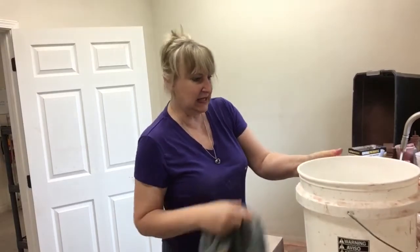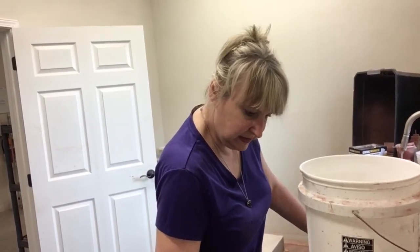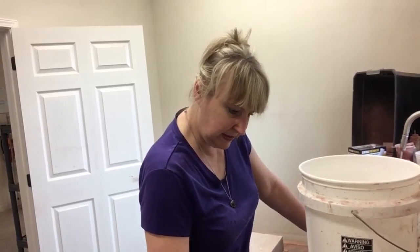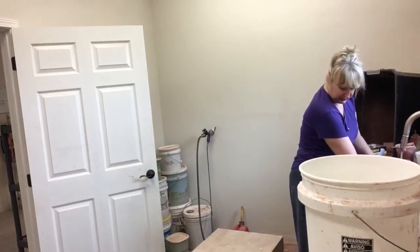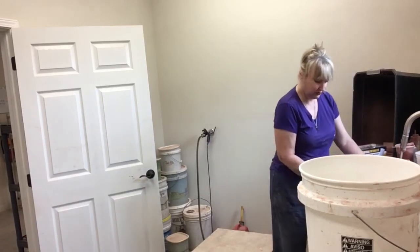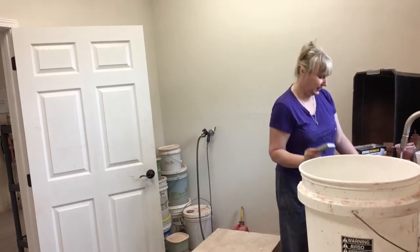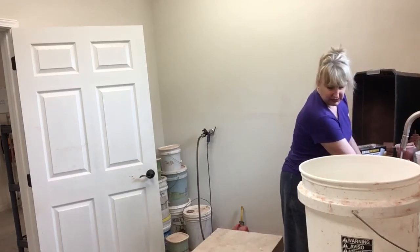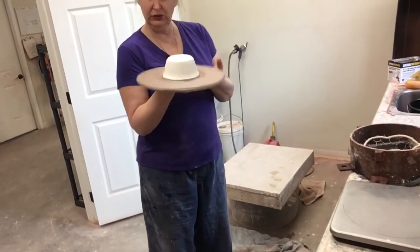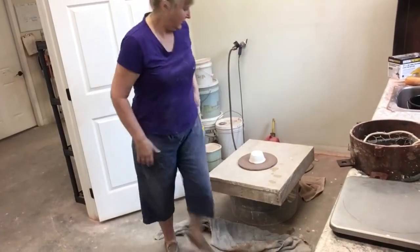I have my scale here, set it to zero to account for the bucket weight, then I'm getting water in and working to get the temperature right at about 72. I'm using a thermometer intended for cooking turkeys — it's quite accurate. I've got the water too warm, so I'm working to get it cooler. Now my model looks really good — the soap is dry on it — and I'm going to set it on the spot where I cast.